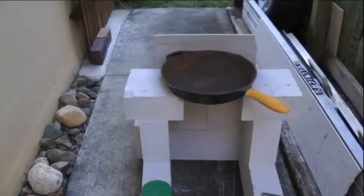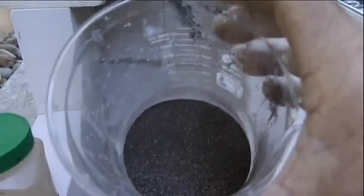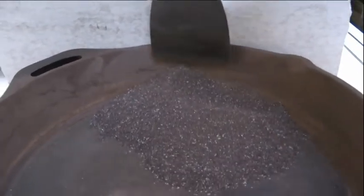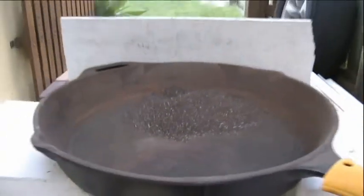I've just been roasting the ore with my map gas. There's some highly concentrated stuff in there — it's black. This was black, but it's gone red now because of the iron, from the last pan. It's all been roasted. By roasting, you drive off the sulphur atom and replace it with an oxygen atom — you turn sulphides into oxides. Non-magnetics become magnetic, and I don't think a whole lot of people realise that.